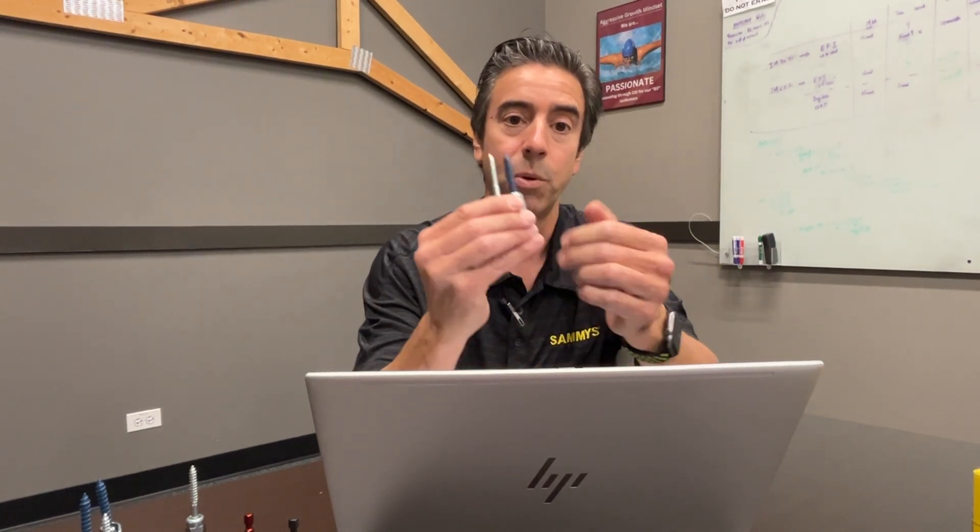You want to use a regular battery-operated screw drive system. There are various brands out there, but that's what you use. You don't want to use an impact. Impact is primarily for high torque — for instance, if you're putting a tire on a car, you need a lot of torque. You don't want to use an impact for these types of fasteners.